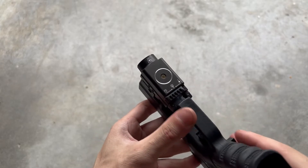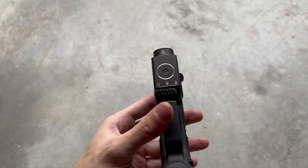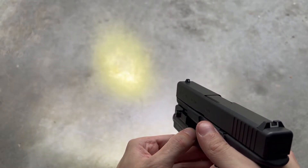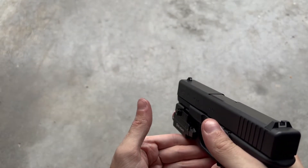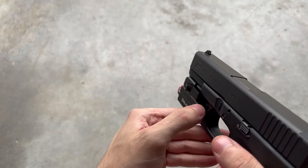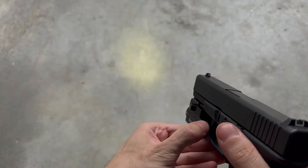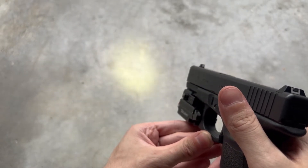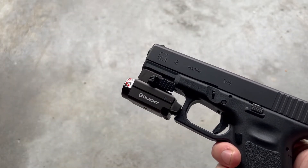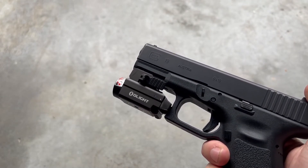Going to the bottom of the light, this switch is how you control when the laser and the light come on. Push it all the way to the left — that stands for light only. Now if I activate the light, you can see only the light comes on. You can hold the switch for momentary on, and the second you release the switch it will turn off, or you can tap it to get constant on, then tap again to turn it off. The standard output is high mode, but if you want to change to low mode for indoor usage, just double tap the switch — now it's in that 100 lumen low mode. Double tap again to go back to high. Low mode may be really useful indoors — if you wake up in the middle of the night, that 800 lumens bounced against the wall is going to be super blinding.